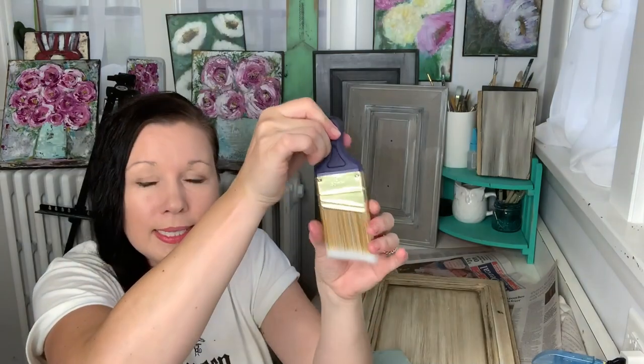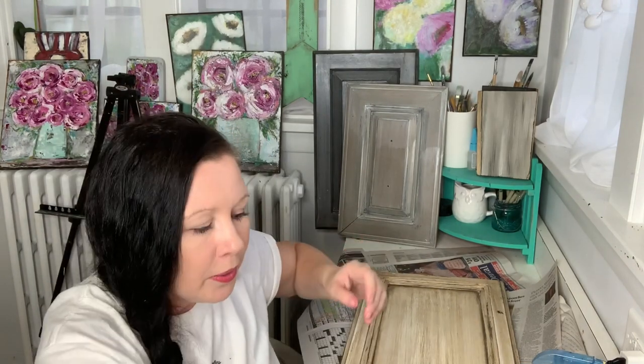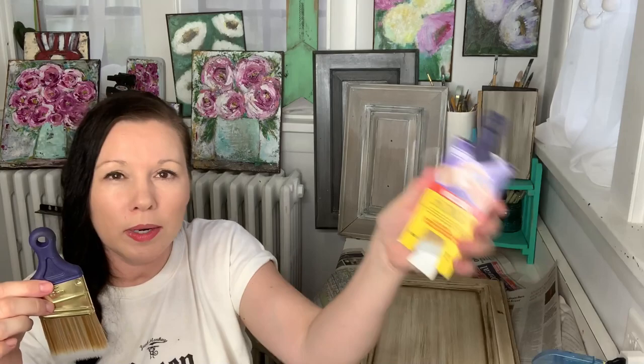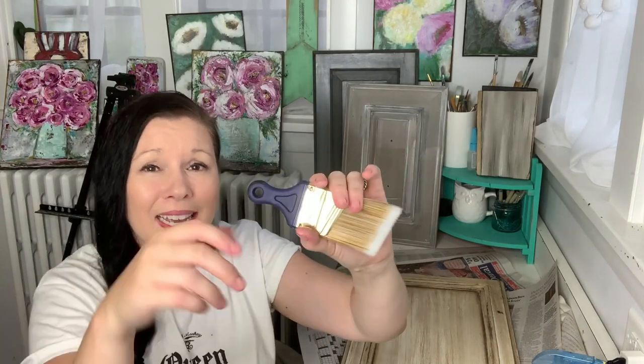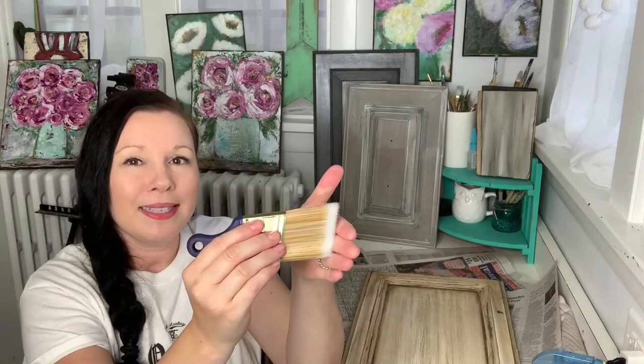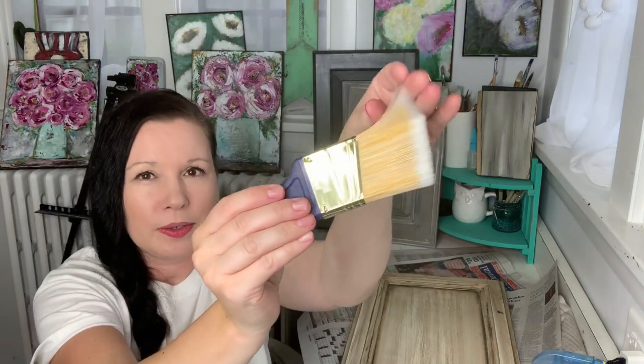I just opened this new one. I like to keep one for my paint. I can't live a day without having paint on myself — at least I know it comes off. Our products clean up with just a little bit of soap and water. I like to keep one brush to apply my paint and one brush to apply my poly. This brush is ergonomic with a rubber handle, which really helps so when you're painting, your wrist doesn't want to break. It's got a nice angle to help you cut in, and these soft, flowy, synthetic bristles. When you're looking to do complete coverage — meaning you want your paint to lay down and really cover the surface — go with something light, flowy, and soft. I always say if you touch a brush to your cheek and it feels nice and soft, that's probably where you want to be.